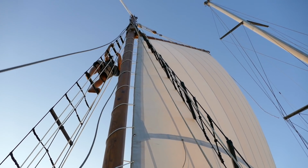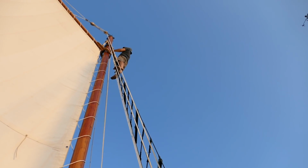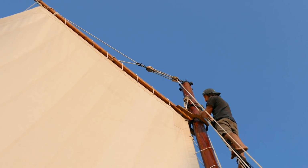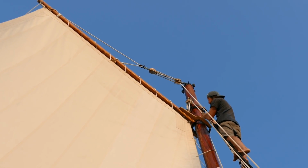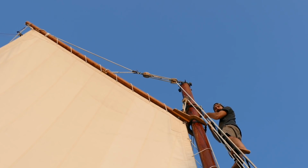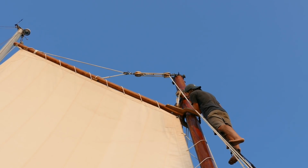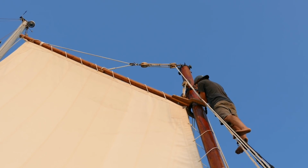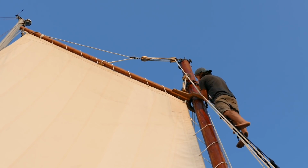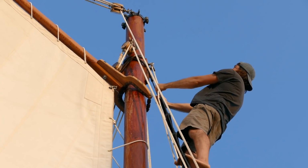Yeah, it's looking comfy now. And the new position of the throat halyard? Oh, it looks perfect. The angle of the gaff is actually exact for where I cut the angles into the end there. Honestly, it looks nearly perfect. Awesome. Bridle looks good.